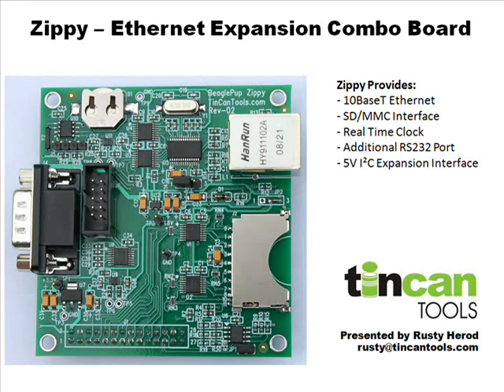It has both a 10-pin header as well as a DB9 male — a more traditional PC-type DB9 connector on the edge. It also exposes a 4-pin header for an I2C interface. It's been level translated so the signals are at 5-volt signals for the I2C, so if someone wanted to interface some peripherals they could easily connect to that interface and add other sensors or whatever peripherals they'd like to add.